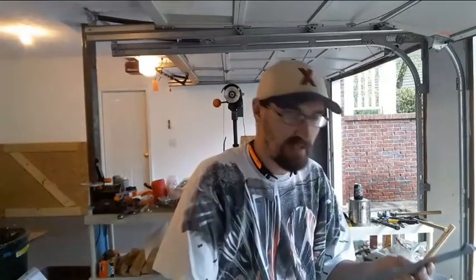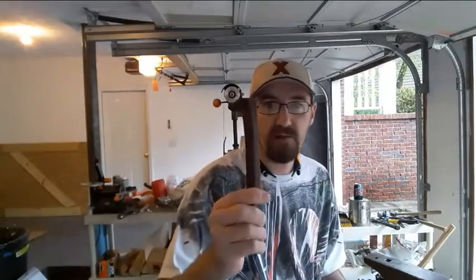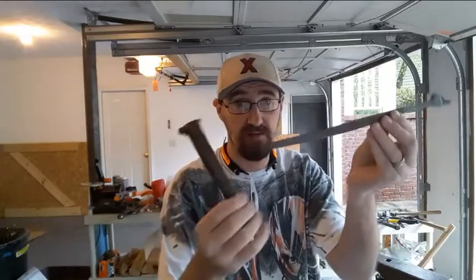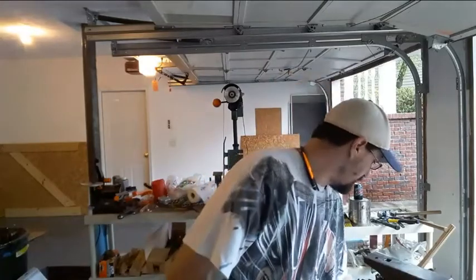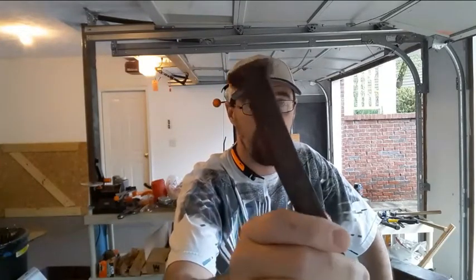But I figured while I was messing with this, I'd show you something interesting. The head of these railroad spikes is still in this end. Matter of fact, there's a little tiny bit of cold shut from working this into the head of the spike into the reins of the tong. So I thought, in the interest of maybe this being interesting to someone, I would do a video demonstration on manipulating this railroad spike head into square stock that you can then work on drawing out.